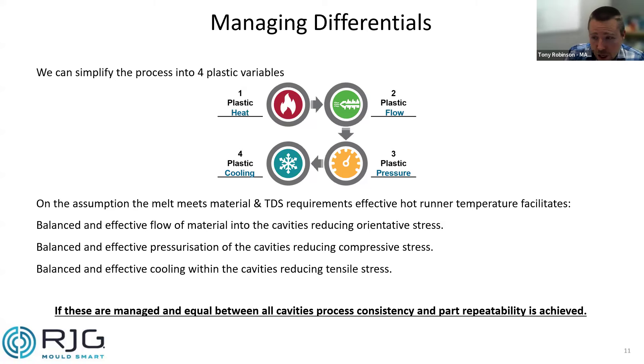The next question: was the temperature the same across all cavities on the hot runner system? To begin with, yes — absolutely. Every sprue bush, manifold, and tip temperature was set the same to investigate the influence of temperature. Then in the second example, we tried to manage that with different tip temperatures to see if it gave a better result. During analysis of the flow through the system, we want to maintain the same temperature so that the overall temperature is the influence rather than potential differences across the system.